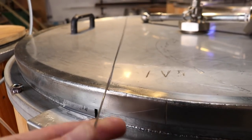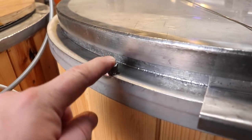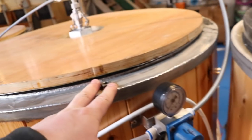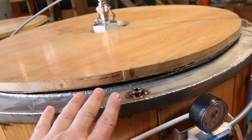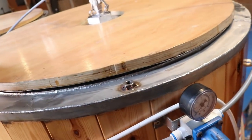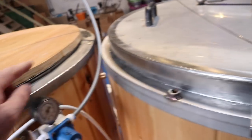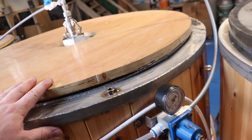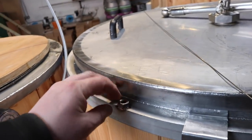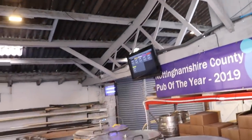This is filler rod — stainless steel 316. I've already been on top of the tanks and we have the nuts in place for the lid tie-downs. These are the tanks I fabricated from scratch and they have full blown square lid type things that sit on top and get bolted down, putting pressure across the whole area of the lid. I think it's a bit of overkill, particularly for these tanks which have a return on them making them more rigid around the edges, whereas these flat sheet ones could bow out of shape if not clamped in all four corners.